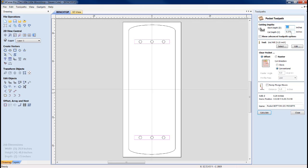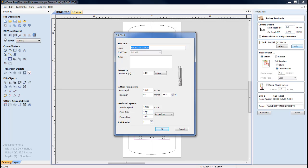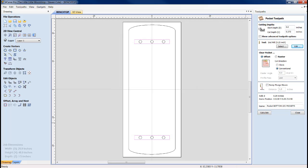I ran these, and I had mentioned in the video throughout the fabrication end that I was going to mill these a half inch, and in fact I didn't. I only went 375 thousandths, or 3/8. We ran the bit at 80 inches per minute at a cut depth of 1/8 of an inch per pass. It went rather quickly. My router, I think, is in need of repair, so I'm kind of babying it a little. And I ran it at a feed rate of 80 IPM.